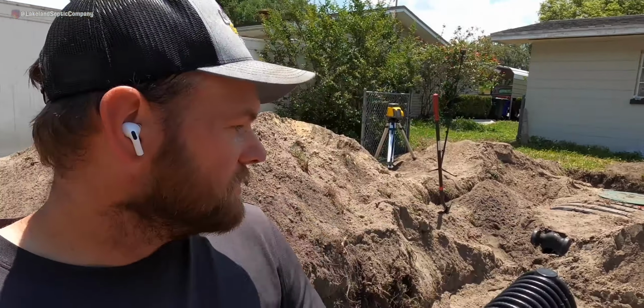It's freaking hot. Still got a pipe in the drain field. That's a quick header. Maybe like 6 feet of pipe. It's right up next, 18 inches off the tank, which is code here in Florida. That's it. And we're gonna lay these 3 chambers. We're gonna pipe it in. I'll show you guys that right now.